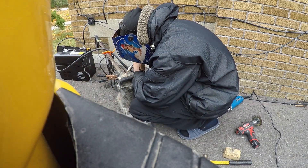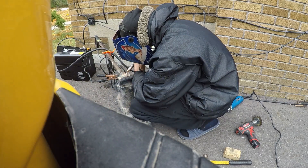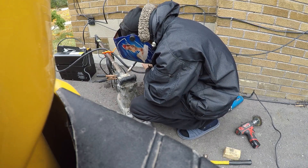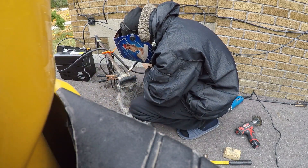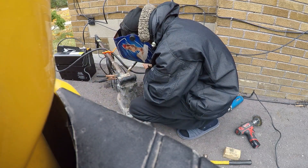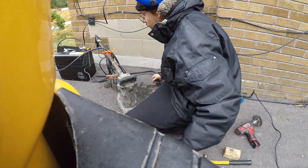A lot of the time when you're dealing with outdoor field jobs with wind, you want to run off of flux core if you can. It also burns a lot hotter and you do not require any gas. You could also use a stick welding process in the field — it's just I haven't touched that for a while.